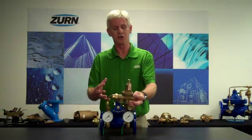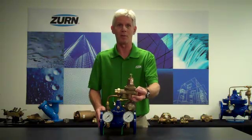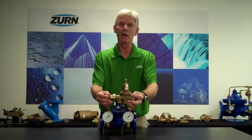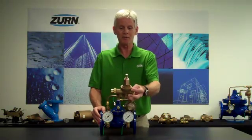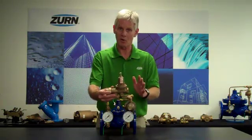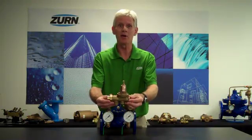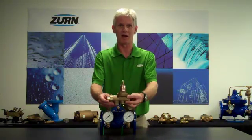What we're trying to do is to encourage all low flows — from zero up to the minimum flow rate of the pilot-operated valve — to go through the direct-acting pressure-reducing valve. You want to choose a direct-acting PRV that will meet the minimum flow characteristics of the pilot-operated valve with approximately a five-psi fall-off.